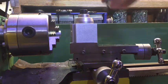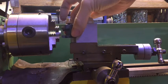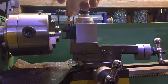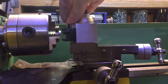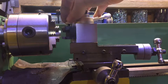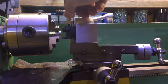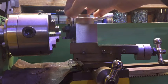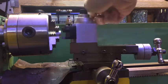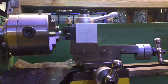I'll show you how the tool holder works. You've got a dovetail here that slides up and down on the tool post. On the actual tool holder there's a thumbwheel adjuster on a piece of threaded rod, so you can basically adjust it up and down until you get it to the right height rather than putting shims in. Once you've got it to the correct height there's a little lock nut on top that you tighten down on top of the thumbwheel to lock it in place. That means every time you put the tool holder back on, your tool bit will be at the right height each time.